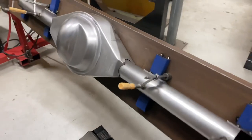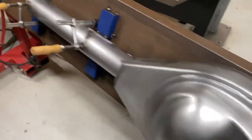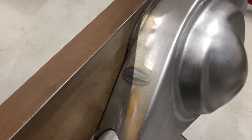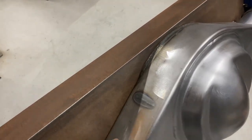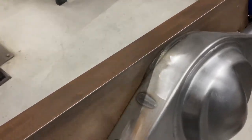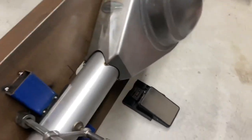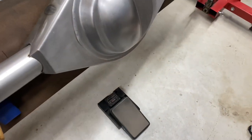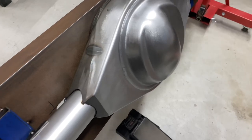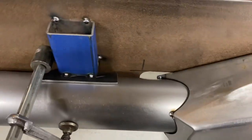All right, I'm fed, I'm happy, I'm relaxed. Did a bit of off-camera tacking - just the axle tubes to the housing. Just wanted to get a bit of a feel for the temperature, what I can kind of get away with. I watched a video once that told me 0.120 wall is like 120 amps, or 0.18 wall could be like 180 amps. I always find that gets me real close in my good ballpark as far as amps are concerned. My foot pedal doesn't have any range in it - it's just a pure on-and-off switch, because I don't like to have my hand cramped up on a trigger the whole time. The fitment's pretty good.